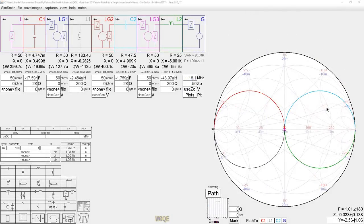Also before we start, I drew this set of arcs on the Smith chart. Starting from 50 ohms, I drew some arcs with some negative component values. This divides the Smith chart into four areas of equal area — two circular and two that are not. The L-matches that are possible to match any impedance in the Smith chart: there are eight different L-matches. Four have one inductor and one capacitor, two have two capacitors only, and two have two inductors only. In the upper area you can match with two capacitors plus two of the one-inductor one-capacitor networks. In the lower area you can match with the two-inductor-only networks and a different one-inductor one-capacitor network, and in the remaining two areas you can match only with two different one-inductor one-capacitor networks.